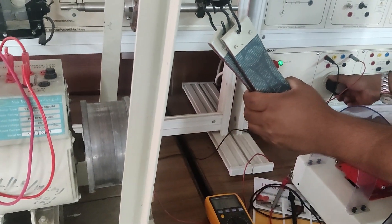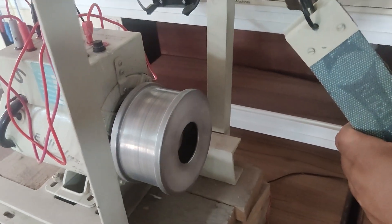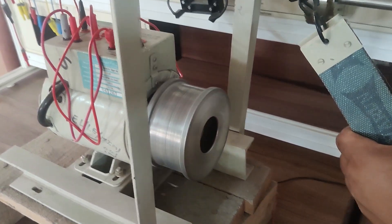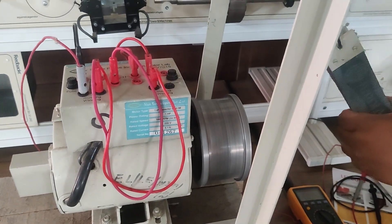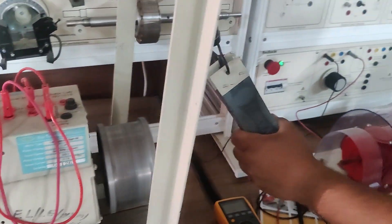You can see, I am increasing the voltage. Now we are running in the opposite direction to the first case. So this was all about how we can set up the rotating magnetic field in a single phase induction motor using the starting winding, and how we can interchange the direction of rotation. Thank you.